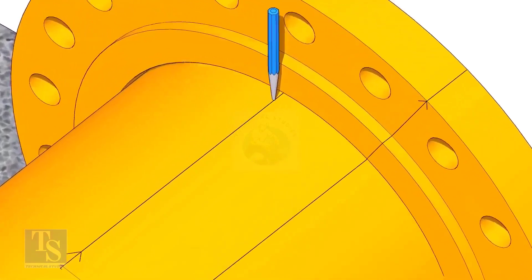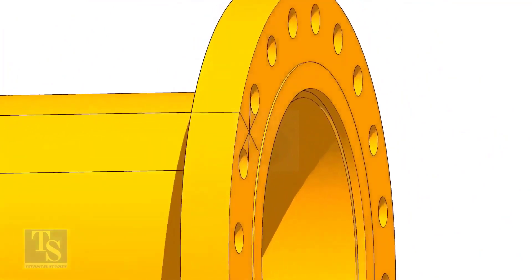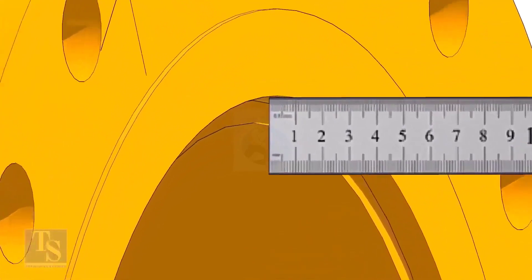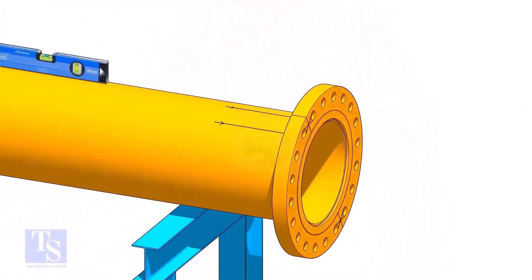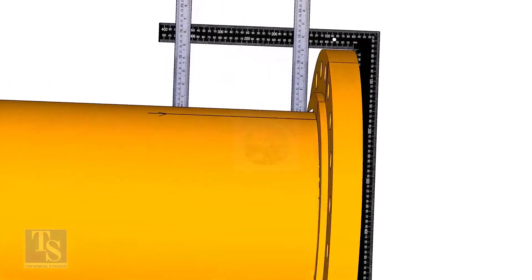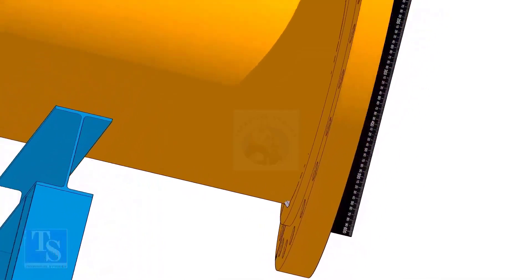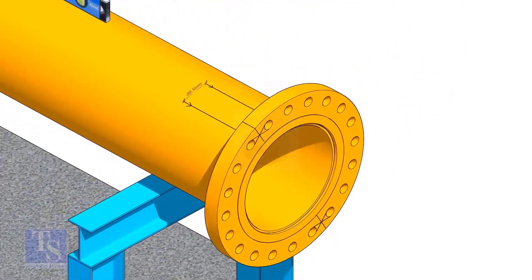Don't forget to punch mark the center lines. Fix the distance between the flange face and the pipe face — usually this measurement is equal to the thickness of the pipe. Tack weld on the top of the pipe with the flange and check the squareness. If correct, tack weld at the bottom side also. Then maintain the squareness of the opposite side and tack weld on both sides.